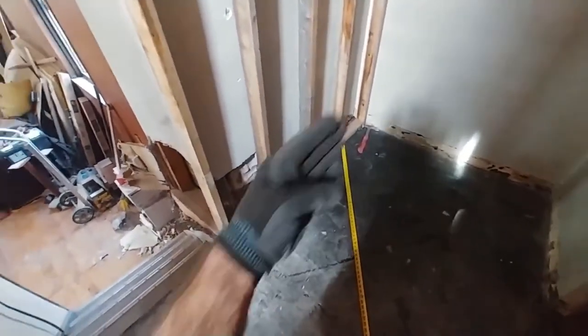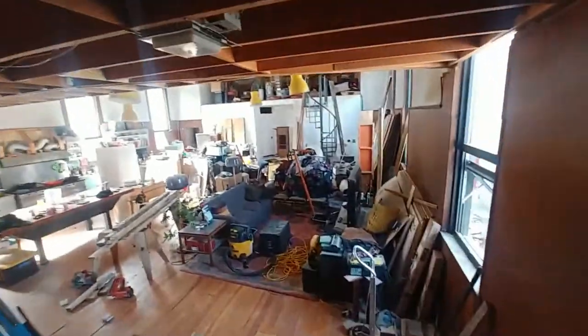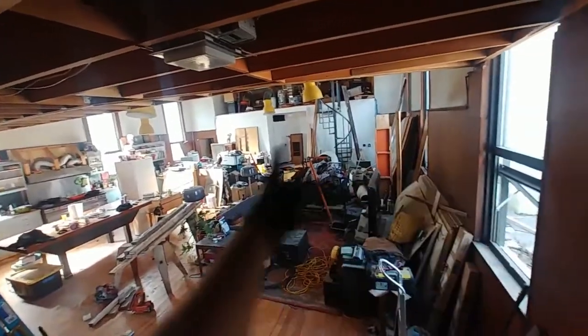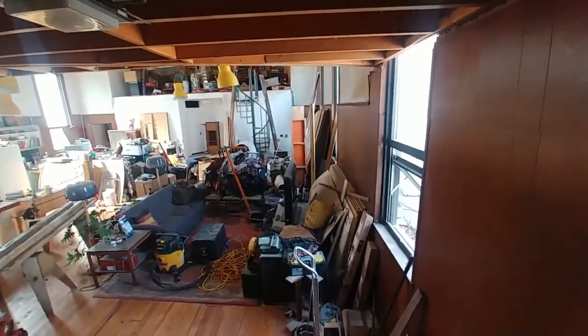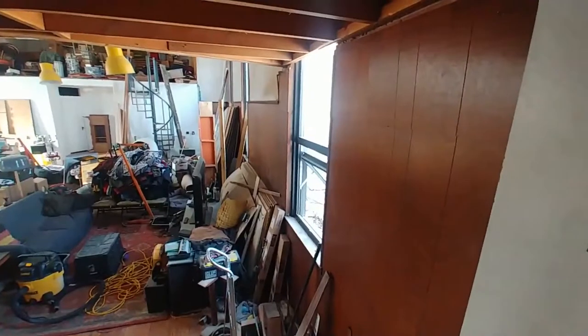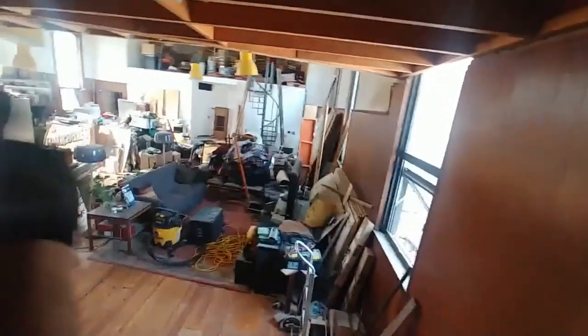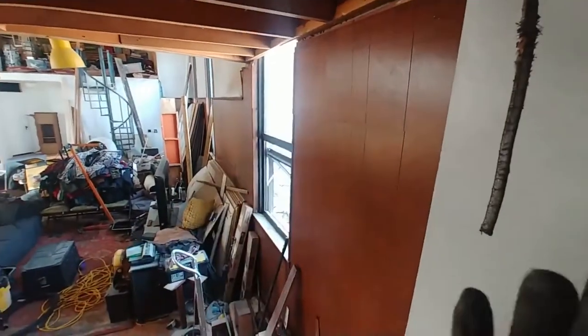This wall's in here at 90 degrees now to the length of the building, and that's sort of where I start here. I'm looking at fundamentals. Like we said, this particular structure is pretty plumb, level and square. The stuff behind me, behind this wall, is out, and it was like a cheap addition, and either it was okay when it was put up and it's moved since then, or it wasn't really even okay when it was put up. So what I'm going to do here is, because we're on this side of the building, forget about that wall over there, we'll use this wall, okay?